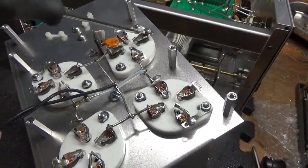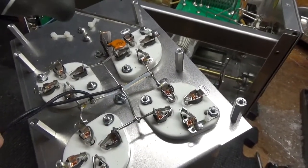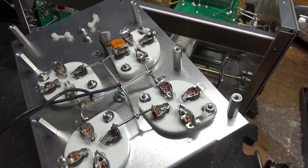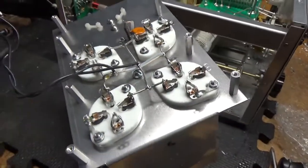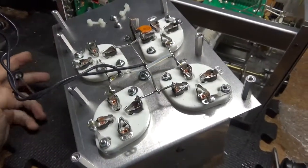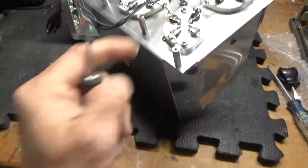The way they make the connection to ground is through this screw. A lot of times these nuts loosen up — there's nothing locking that nut in place, plus they're going through the screw. What I do is drill a hole and go directly at the chassis. So I'm going to go ahead and get this all done up. I'll ground the grids the way I do it and I will add the two gas discharge tubes.